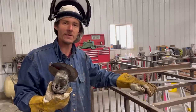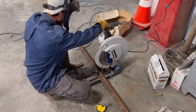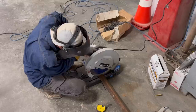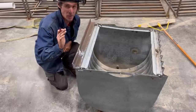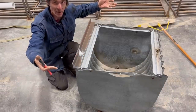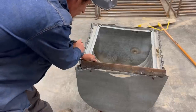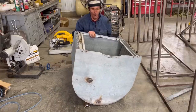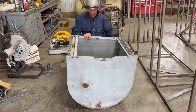I use the cutoff wheel like a grinding disc — what are you going to do about it? For my scallop pattern, instead of trying to get scientific with it, I'm going to keep it simple. Why not just trace the scallops that are on the damn bin, right? I'm going to have to get a little creative. Because this thing's kind of being a pain in the ass and it's wobbling back and forth on me, I'm going to go ahead and weld them up with a piece of angle iron down the bottom so that way it'll sit still.